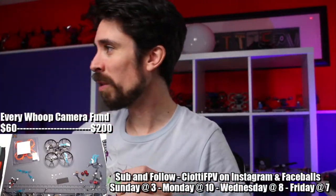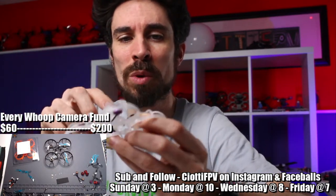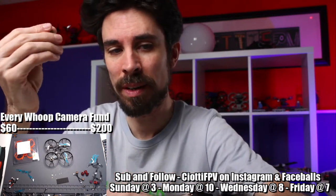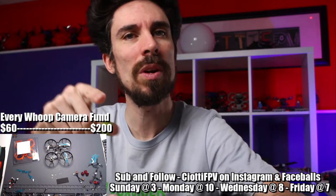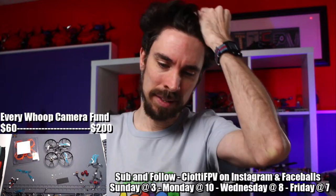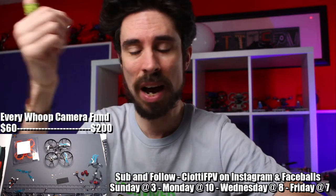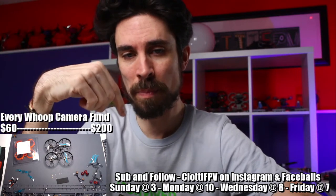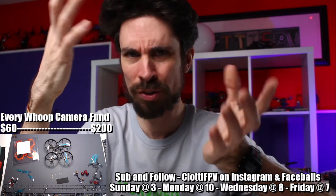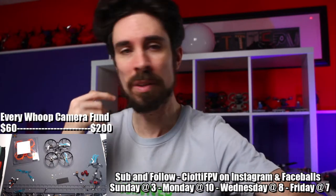Got it done. All 4 of them are spinning fine. I had a hell of a time getting the last 2 of the bells out of the red stators. No, the one on stream went fine. After the stream, I did one more motor the next day, and I could not get, I don't get it. The motor shaft would not come out of the stator. The very bottom of the motor shaft where the C-clip goes was slightly bigger for some reason, and it would not go through the bearing. The bushing, rather.